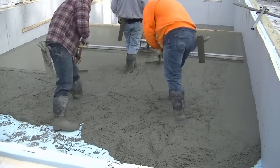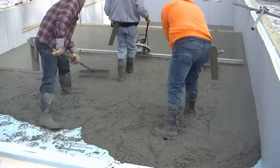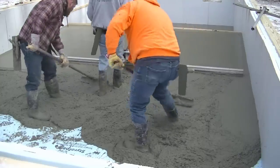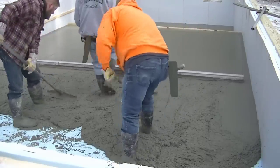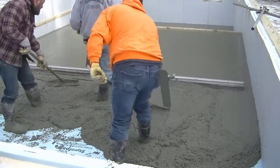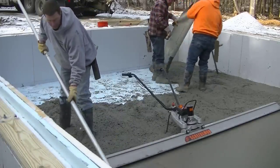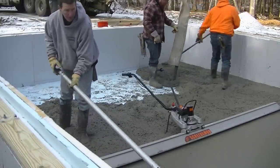And it's really light. You can see how nice and even that gets the concrete. And it rides right on our wet pad. So we magged a wet pad on the wall according to a chalk line we had there. And then we just used the other wet pad on the other side. We're going to get a little more concrete poured out.